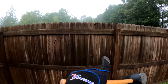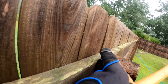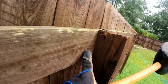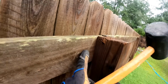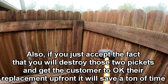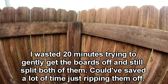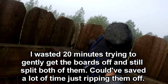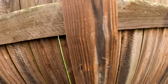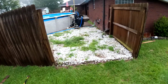So to take out this fence panel, we're finding out what the last picket that's on top of this cross member is, because this cross member is what holds this panel into this post. So we're knocking this one out. Sorry, spider, gonna mess up your house. And then I think this one. This is something that's a lot easier with 2 hands. Fence panel's off. Now I've got good access back here.